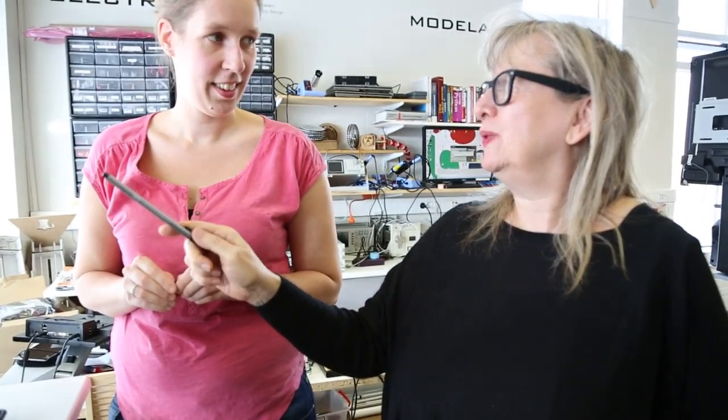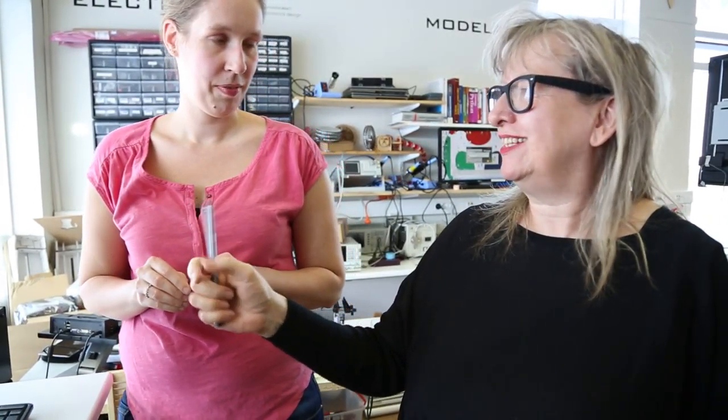But could we print with support and without support at the same time? If you print two objects? I would recommend against it. Also, the printer can make mistakes, so that will influence your test. I would say print one at a time. But let's say we do want multiple of the same object, you can just copy and paste. It is possible, but for testing I would recommend against it.